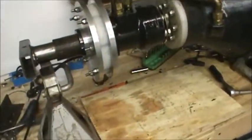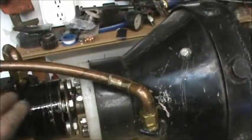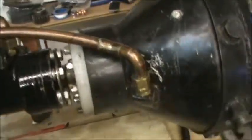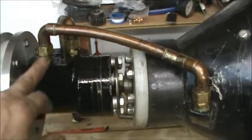Basically what's going on is, rule number one, this is not the proper hydrostatic motor I need. I actually need a vane motor. This is pretty much not a typical vane motor. Vane motors are able to handle a lot of RPMs. This thing locked up around 1,100 RPMs, which is a no-no.